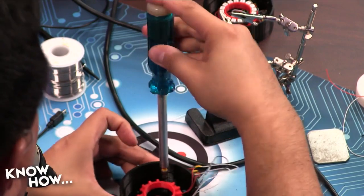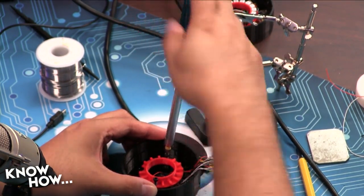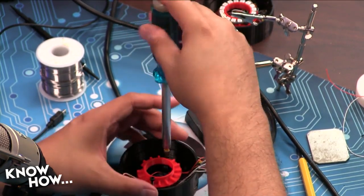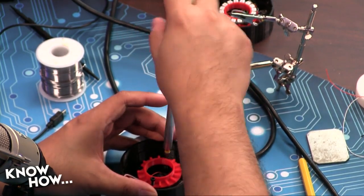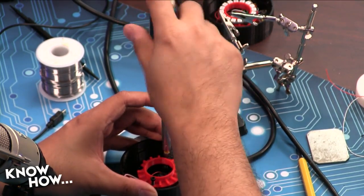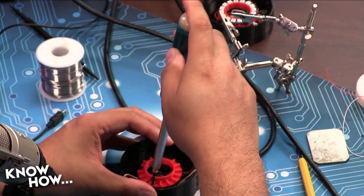Oh, let me do that. And I bought a bunch of these M3 screws just because they are useful for pretty much everything. And that's the reason why this thing has fins, those little protrusions, is because that will hold the LED ring off just enough so that those screws will not come into contact with it. And it also allows it to sort of cool.